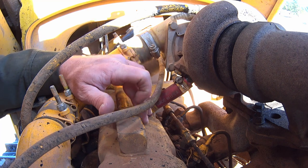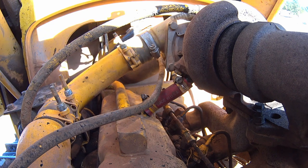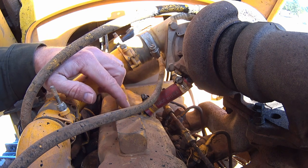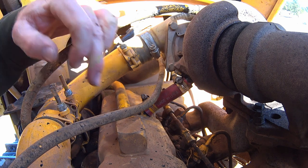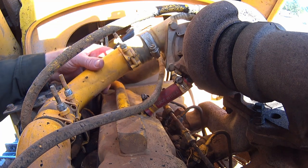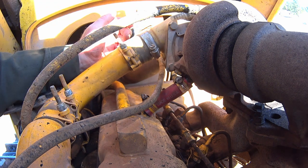With the turbo draining back into the valve cover here, that's fine and dandy. But this breather tube goes out the back of the engine, drops down, and goes down into the belly pan. That's fine, but let's have a disconnect here. The way this guy here comes apart is you literally have to take a bolt back here at the back of the valve cover apart, pull up on it, and drive it out of its socket here. Rubber hammer, etc., whatever. This turbo pipe comes off relatively easy, just undoing the two slip joints here, and hopefully you don't tear them.